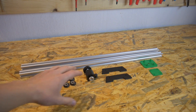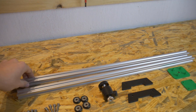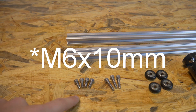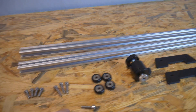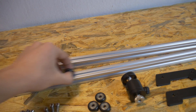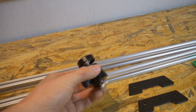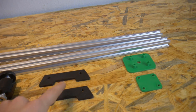Here I have all of the parts that we need to build this camera slider. We need two 20x20 aluminum profiles. We also need M5 screws 10mm long and M5 screws 20mm long, four wheels that work with the aluminum profiles, a ball head for a camera with a screw so that we can easily attach it, and four 3D printed parts.